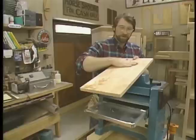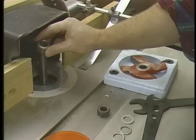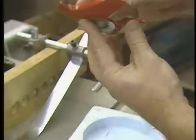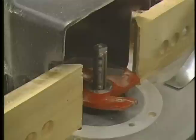My thickness planer does a real nice job smoothing out those blanks for the raised panels. I'm going to change my cutter for the next operation. First, I'm going to put a collar on and raise the blade up a little bit. The cutter this time is a panel raising cutter — you can see by this profile that it's going to cut a tapered panel. It's much bigger in diameter, five inches in diameter, so I've slowed the speed of the shaper down. I'll tighten it on and we'll run some panels through.